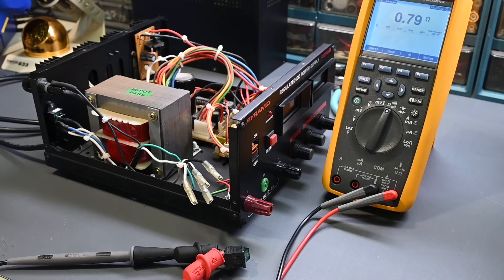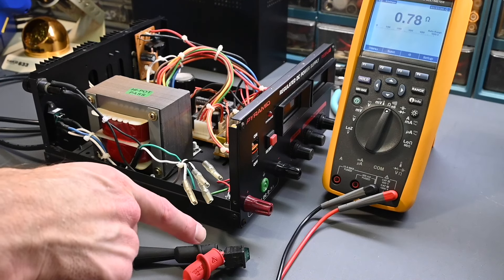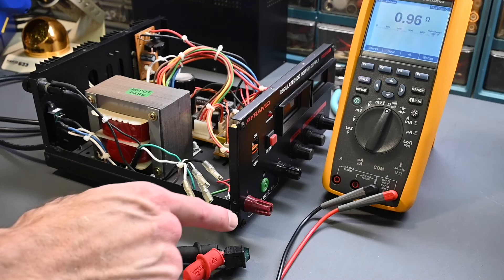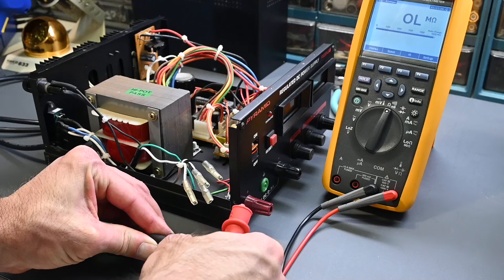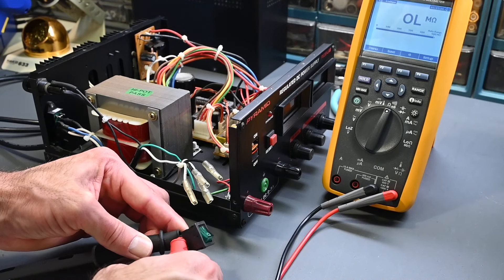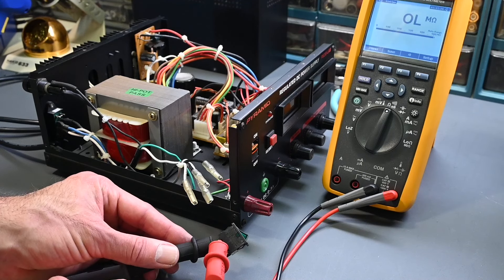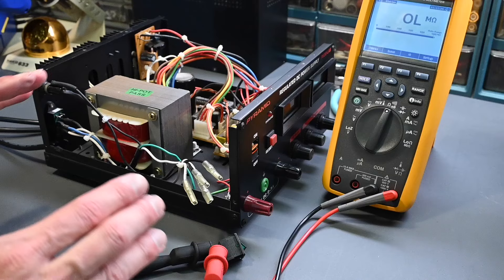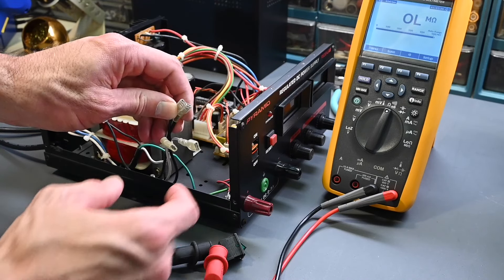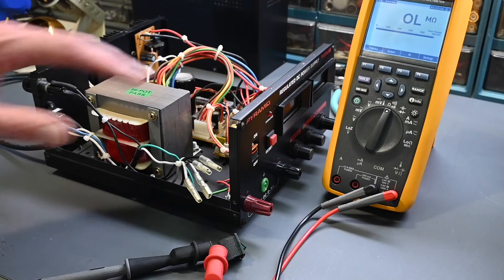It's unusual — this power supply has been in use on my bench for over 20 years and worked flawlessly, and then in one evening all these problems developed: a faulty fuse holder, a failing switch, and we still don't know what's causing the excessive current draw, because the switch problem doesn't explain that — there's not a short between the hot and neutral sides of the switch. I'll put jumper wires between the black wires and between the white wires to bypass the switch, get a new switch ordered up, and continue troubleshooting the excessive current draw.